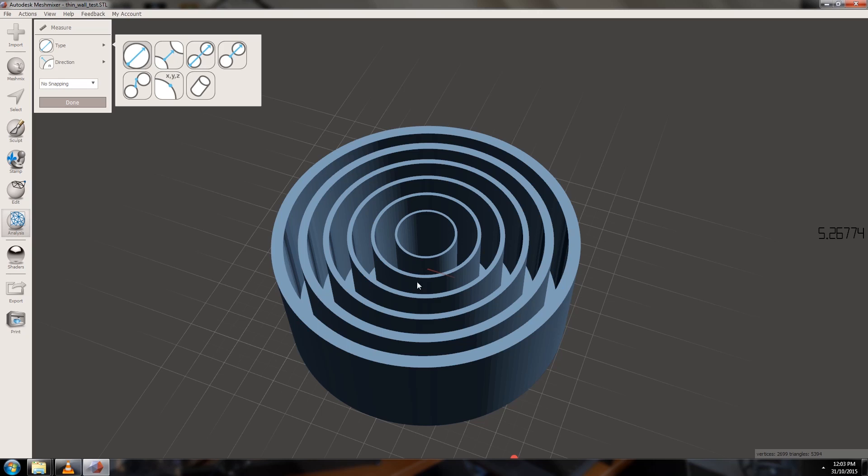So this got me thinking — printing thin walls on an FDM 3D printer is actually pretty challenging. If you think about it, the nozzle diameter is 0.4mm on your average FDM 3D printer. So theoretically the thinnest line it can lay down is 0.4 millimeters. But a lot of models, especially from architectural students who scale their models down from 1:1 to 1:500, walls become paper thin. So how do 3D printers handle this? Something's clearly changed in the latest version of software, so I decided to do a bit of investigating.